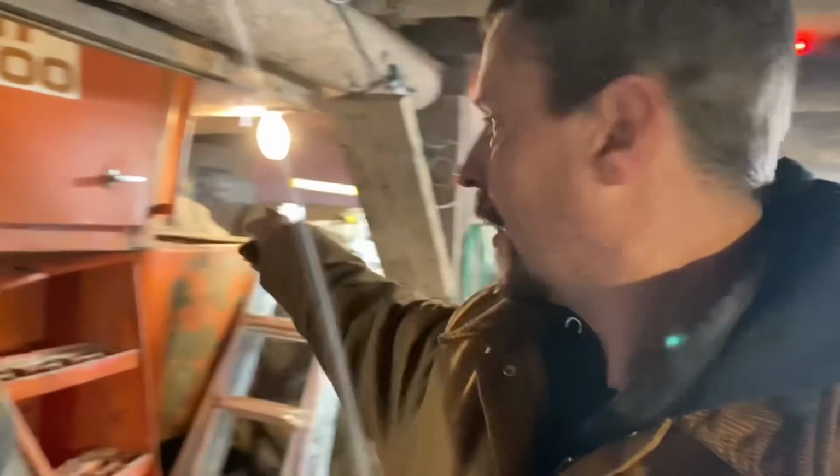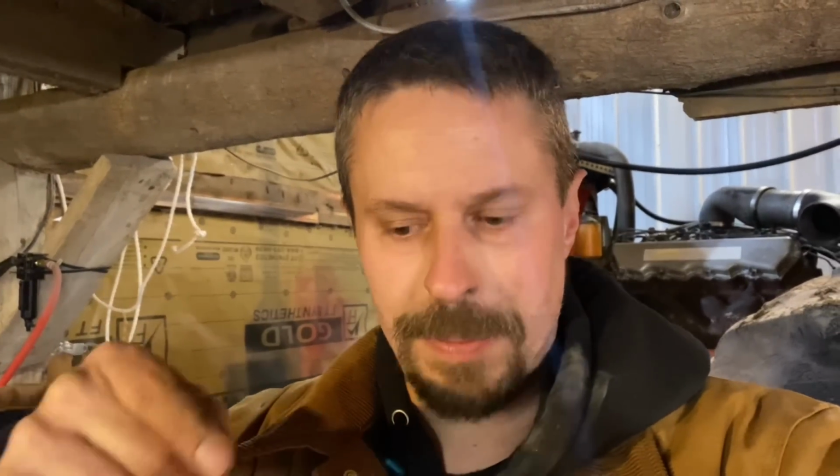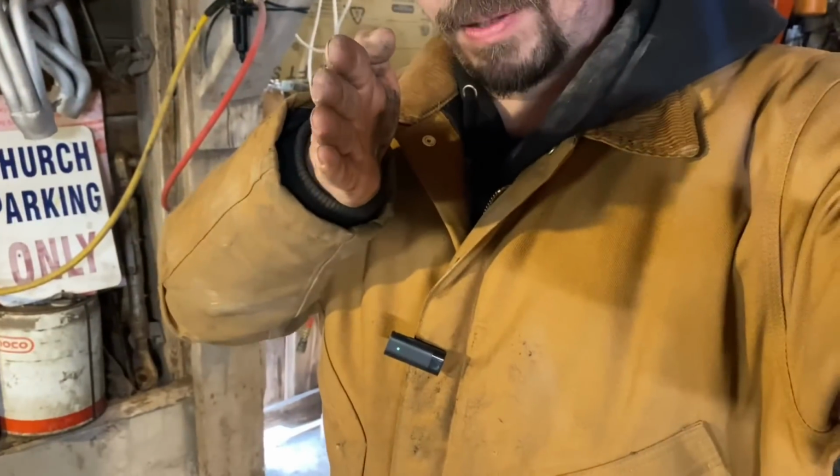I'm going to go and get myself some pressure and return line, plumb all that stuff in. The other thing that's a minor holdup is that pump. That pump is not hooked in right now. So I think what I want to do is disconnect the hoses and pull the pump right out. I'm going to double check the pilot holes that hold that pump in place because they're probably wobbled out and egg-shaped. You might have to weld a little bit in there and then take the die grinder and make them round again instead of egg-shaped, because when they're egg-shaped, your belt pulleys kind of want to go like this, and that'll wear your belts out fast.